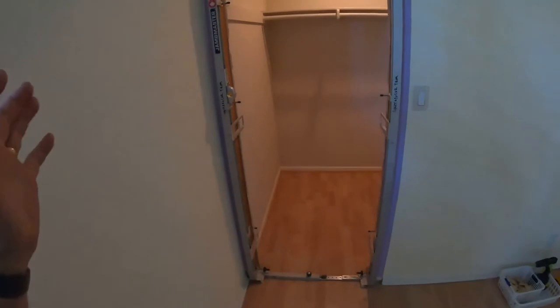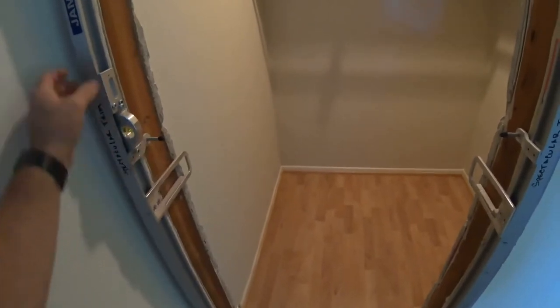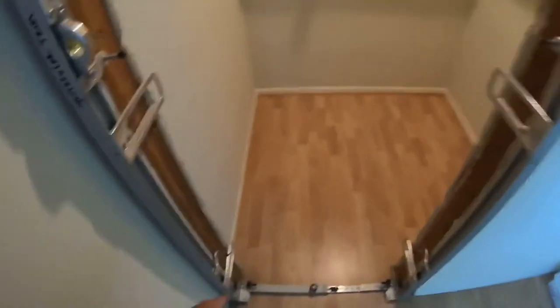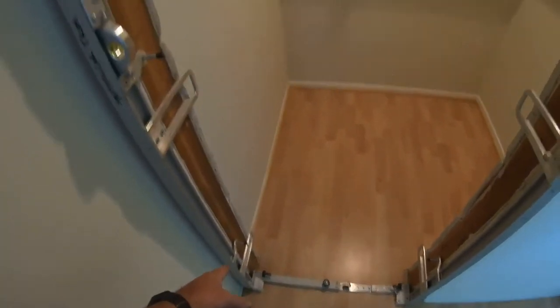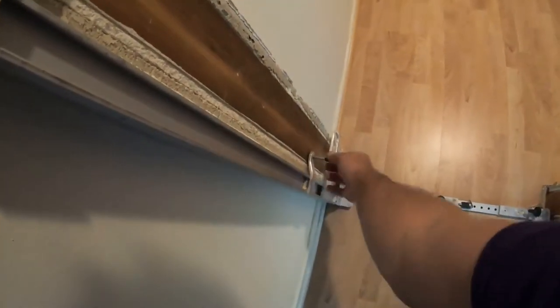All right, here's the process. What you do is take the jig, put it in the opening, and checking the level, you start and you just take the slack out. You don't crank down on these. This is still a frame that you can distort if you over tighten anything. All you're gonna do is get it into position, use these top and bottom stretcher attachments and these bolts to maintain level, plumb, whatever. And once that's good, then just take the slack out using these stabilizers.